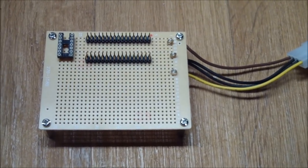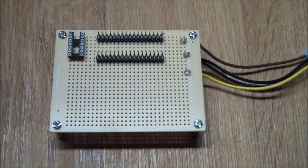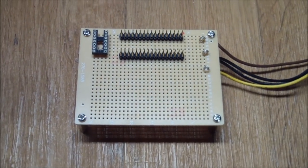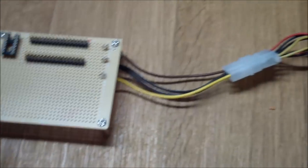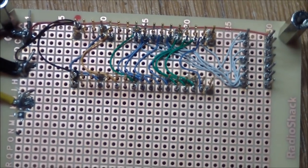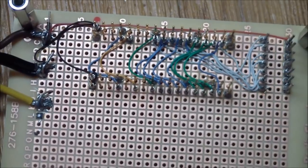And the power connection you see on the right, the only purpose for that was I needed 5-volt power for the pull-ups to work. And since I'm not using pull-ups anymore, I don't need that either. So ignore the wires coming out of the right and the socket on the left. It's not necessary. This was basically made using modern wire wrap technologies, and it just follows the diagram that I showed you previously, connecting the wires. And things will get a little bit cleaner if I go in and remove the power connection and the socket for the pull-ups.